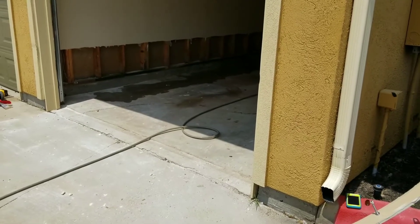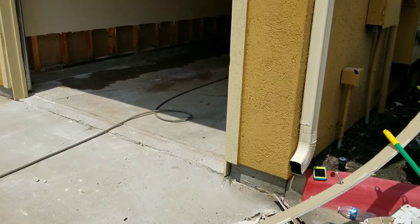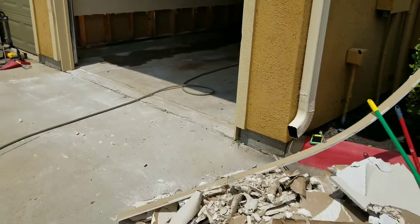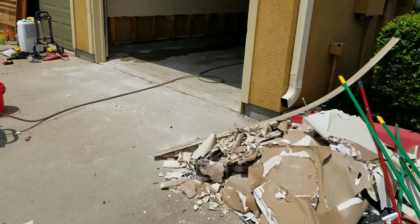That's the floater tape from when they floated the sheetrock and put them together. Once you do that, the sheetrock pieces will just come out without having to cut them. You'll still have to pull them off the sheetrock nails, but it'll come off without having to cut the wall.